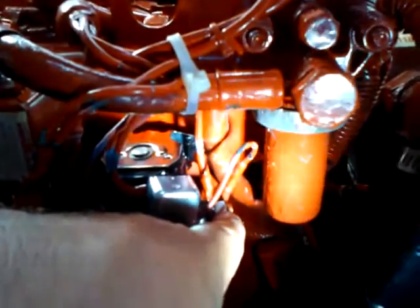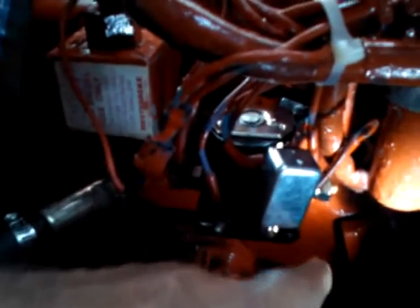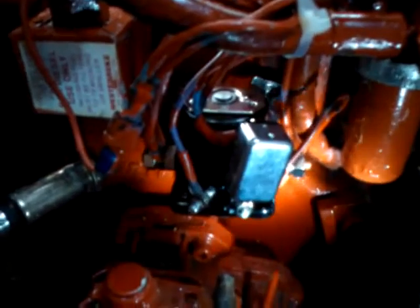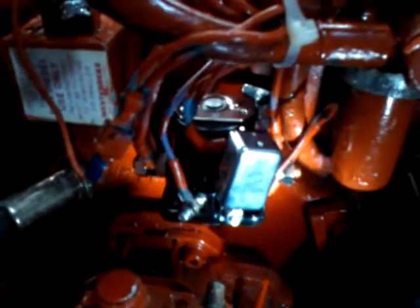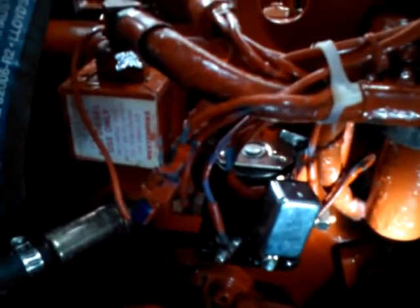On this side, these are the glow plug connections — that's where they're hooked up and they run the glow plugs. On this Westerbeke engine, there's a resistor that hooks up to the I output and goes down to the ground connection on one of the support bolts in the back. That's the solenoid — works great. You hear it click and you hear the fuel pump go when you start the engine. There you have it.